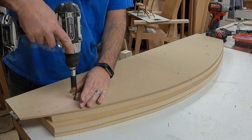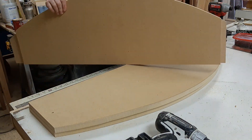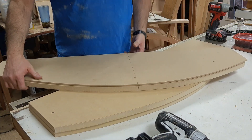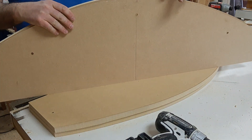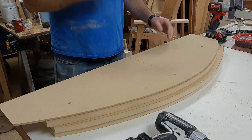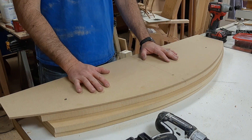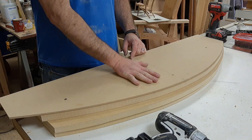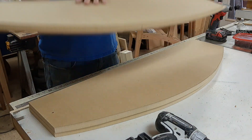Now that I have this secured, this is what it's going to look like. I have a little extension with my template here, a lot over there. I have extra material on the three-quarter side, so this is ready to go for trimming it down. What I'll be using is the router table. The router table is going to work because I have a pattern maker bit — bearing on the bottom, cutter on the top. The countersink on these screws is critical because I'm going to be running this inverted.